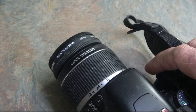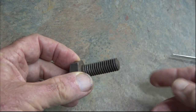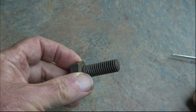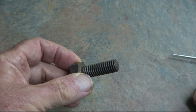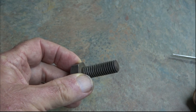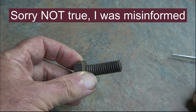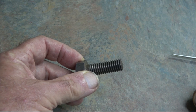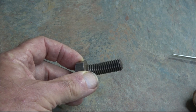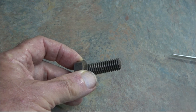Now with that bolt, say for argument's sake it was 4 TPI, you would actually need 4 turns of the nut to get it to move an inch, whereas of course if you had a 4-start thread you only need 1 turn to get it to go that far. So what I should now do is go on and describe two methods of cutting multi-start threads on a conventional lathe. Join you in a moment.